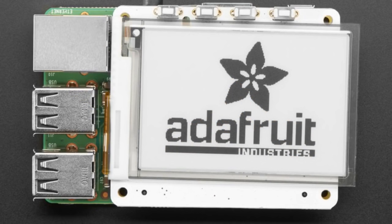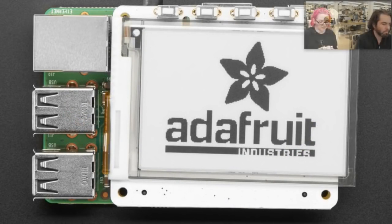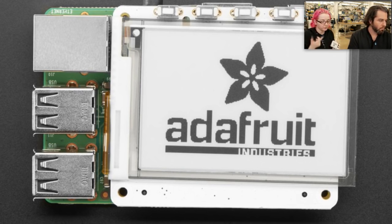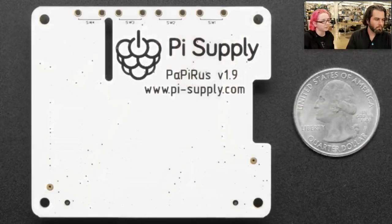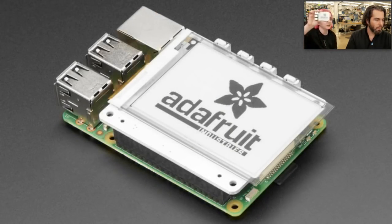While the Pi is booting and RetroPie is happening, next up is this e-ink hat. It's like the big sister to the Pi Zero version — it's called the Papyrus. It's got a nice 300 by 120 pixel e-ink display. I'm holding it up and there's no power, so it keeps the display working even when unplugged. That's one of the great things about e-ink — it's daylight readable and doesn't use any power. This works with any Raspberry Pi, best with Pi 2, Pi 3, and B+. It even has a real-time clock, optional buttons you can solder in, and a pogo pin that connects to the reset so it can control or reset the Raspberry Pi.